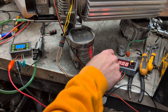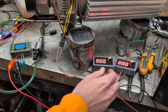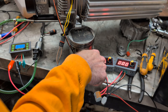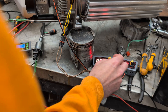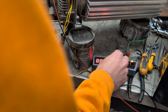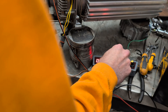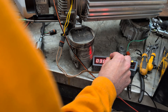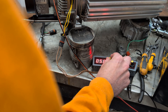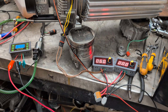So this one is the glow plug. The twiddly knob is your adjustment between 0 and 100%, and you press the knob to turn it on and off. They do have the annoying thing where, if it's set at 0 and you press it on, the green light doesn't light up to tell you that it's on until you move it to about 1%. Being the glow plug, I'll move it to about 5% and then turn it on. The green light has come on, and now we'll ramp the glow plug up to about 60% — 30, 40, 50, 60%. So that's giving us about 60% of 12 volts. You could probably go 80%, it'd be fine. And then we just kind of hover about there for like 30 seconds.